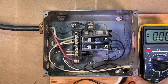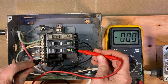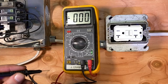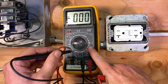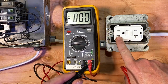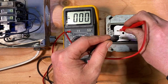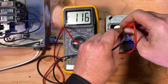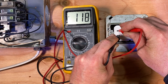You can also test with the meter here — if you have these breakers on, test from the neutral bar to the lug on the breaker. You can turn these on and off and see if you've got power coming through. Likewise, if you want to test an electrical outlet — I've got a GFCI outlet set up here — with AC volts set, poke one lead in here. The bigger slot is the neutral side, and the smaller one is the hot side. Put one lead into one side, the other into the other side. We're getting 119 volts on this outlet.